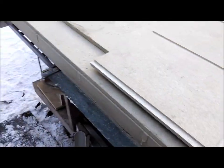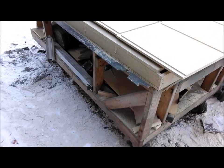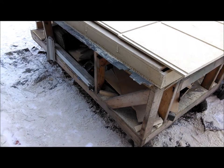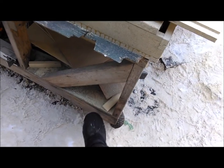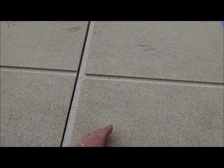For those who aren't aware, our torsion box down here and the whole table saw that's going to be replacing our current table saw is going to be 100% modular when finished. Rather than the current setup where the table saw is at the end with outfeed table and unused storage underneath, this router section will just bolt on to the torsion box base. That base is going to replace the bottom torsion box base made with 2x4s. There will be another section of drawers on the other side and the table saw in the middle. If at any point I feel like changing anything up, I'll be able to unbolt it and move things around kind of like a big jigsaw puzzle.